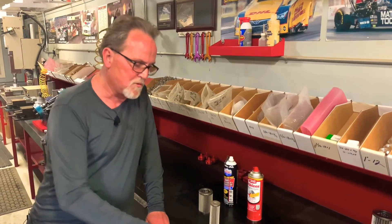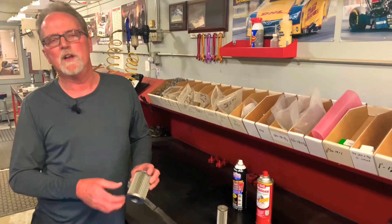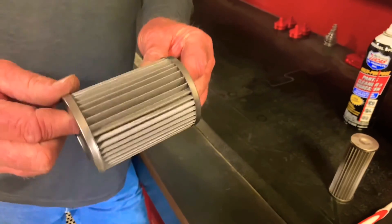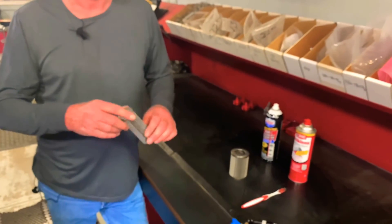For the guys who don't actually clean their filters or do what they're supposed to, it can start building up a glaze on the outside of the element. When it does, it'll actually shut itself off from the glaze and eventually it's going to collapse the element. The same thing happens on the inline pieces as well.